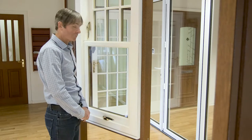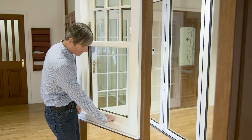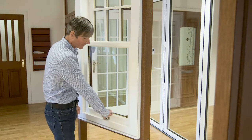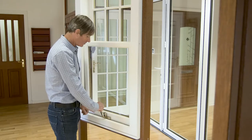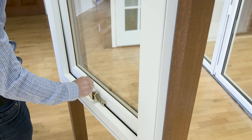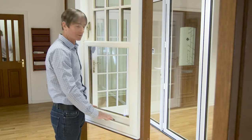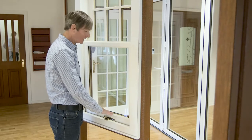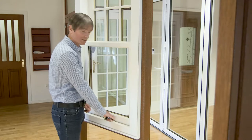To operate the double swing window from inside, what you have to do is push the button in the handle. It will open the handle out, push the sash out approximately about 1cm away from its frame, and close the handle. This is what's called the night vent position. This will give you night ventilation when the sash is actually in a locked position.